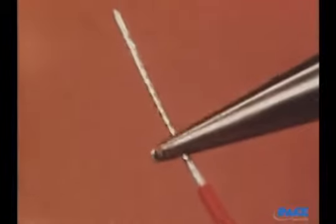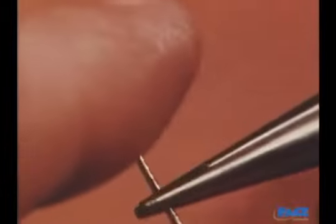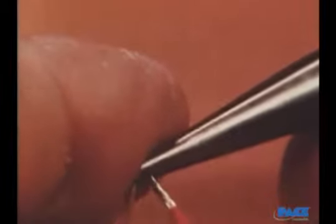First, the tinned wire is put across the terminal to determine the proper insulation gap. Then a 90-degree bend is put in, using a pair of chain-nosed pliers. The wire is positioned and then trimmed so that none of it protrudes beyond the diameter of the terminal.